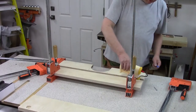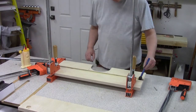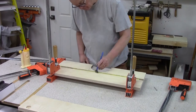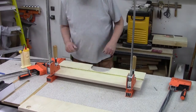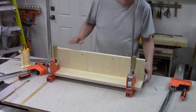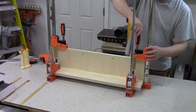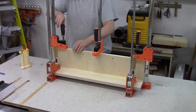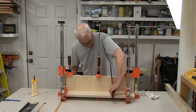Now we're ready to glue this little thing together. I've got the glue in here and I'm using my brush to smooth it along the edges of the dado to make sure we've got some coverage there. Notice I've got two clamps that are acting as legs — makes this thing really easy to get the other clamps onto it on the ends and then one in the middle and get all that tightened up.